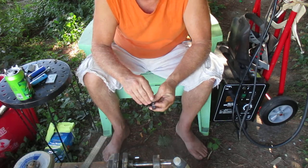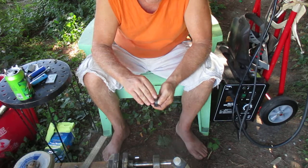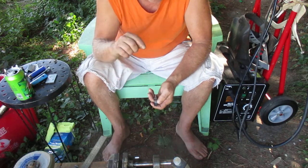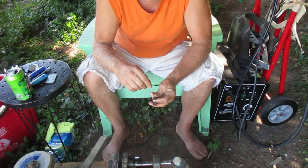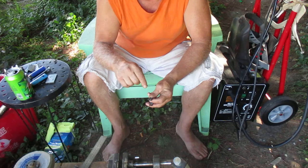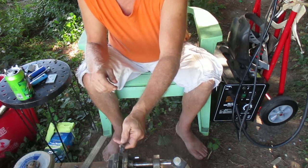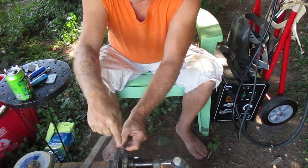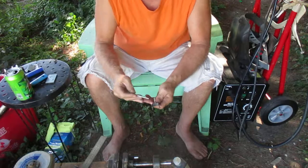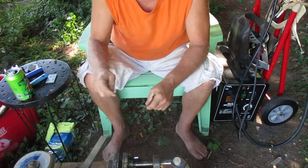Drill an 1/8 inch pilot hole in your center punch. Come to the other side. 1/8 inch pilot hole. Go to a 1/4 inch bit. Go through the pilot hole, bring it out to a 1/4 inch. Flip it back around. Go through the pilot hole, bring it out 1/4 inch. At that point, make sure it's in your vise when you do this. Just go all the way through both holes. That way you can be sure that your 1/4 inch bolt goes through it no problem.